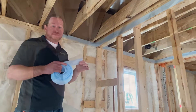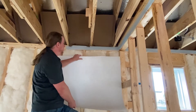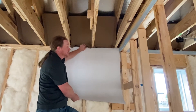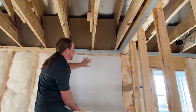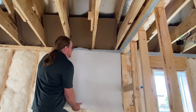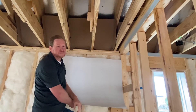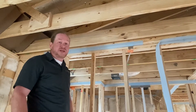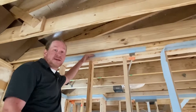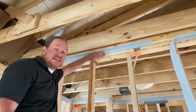With this stiff material, when your drywall or sheet good is installed it needs to lay flat over the top plate gasket in order to form an air seal. If the gasket is wavy or the corners are rounded, when the drywallers lift the sheet into place it becomes snagged. The seal is going to be between the top plate and the drywall.